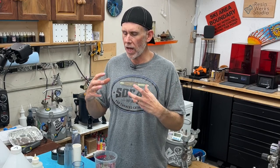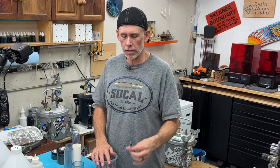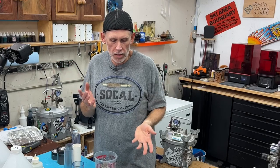Wood is easy. You just pound it in and it's going to crumple the fibers. But with plastic, it doesn't give. There's nowhere for it to go because it's a solid surface. So I don't think a slightly oversized hole is going to be a problem. All I've got to do is tap threads in that thing and then use a stopper mandrel to hold the piece on the lathe. Pretty simple way to go.